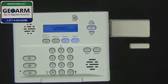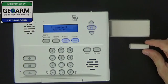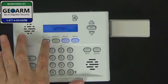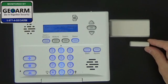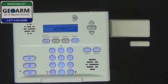Now I'm going to show you that if we remove the contact and select doors and windows, it's saying that the front door is opened and it's not allowing us to arm the system. As soon as we replace this contact, it will begin arming the system — and it's going through its arming process.